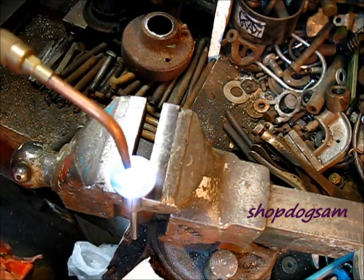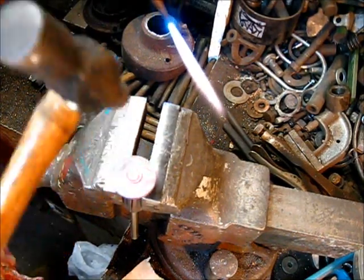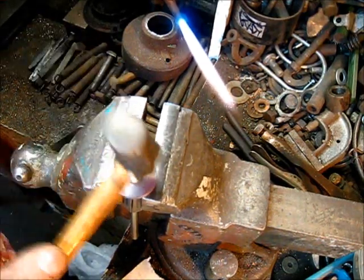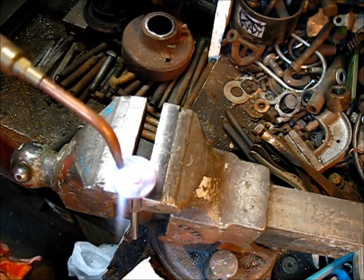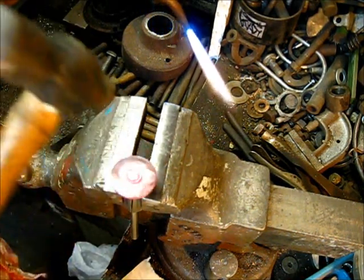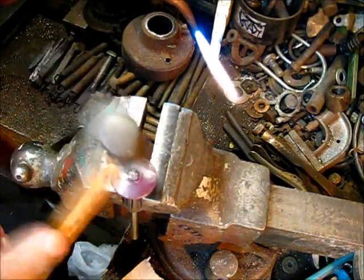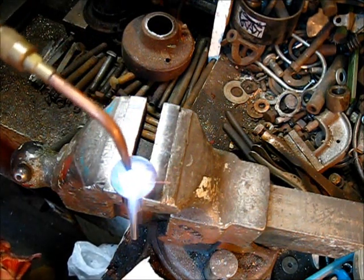The stem is 1018 steel that I'm using right here. For the inquisitive type, it's a decent choice for these old engines — works good, it's cheap. That's not to say the next valve I make won't use a tool steel for the stem. You can get by with most anything.